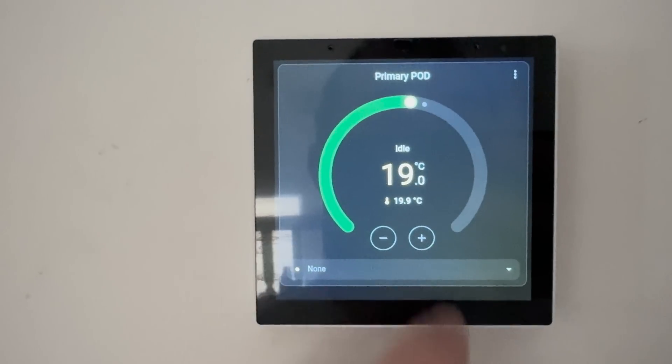I'm going to tell you about something you can do if you've got Octopus Intelligent Go and how you can manipulate it to work more cleverly. Because we've got this integration in, we can tell it that if it sees Octopus Intelligent has allocated intelligent hours, we can go to Automation Settings in Home Assistant and say: if the time is earlier than 11pm, the car has allocated intelligent hours, and the tank heating is below 40°C, boost the hot water for 30 minutes to 50°C. You could also have it boost the heating by an extra 1 degree, or turn your battery on for half an hour.